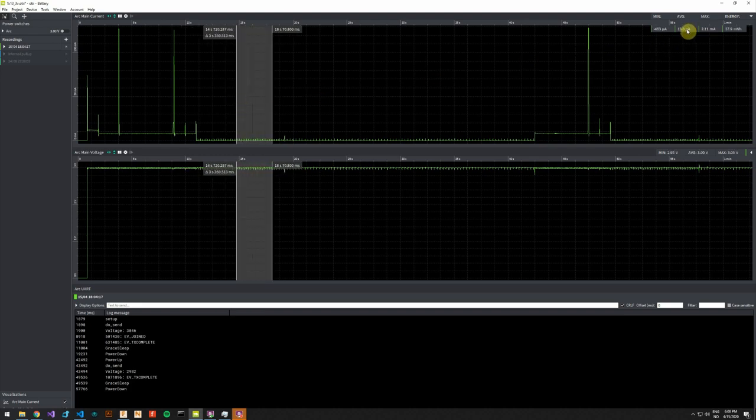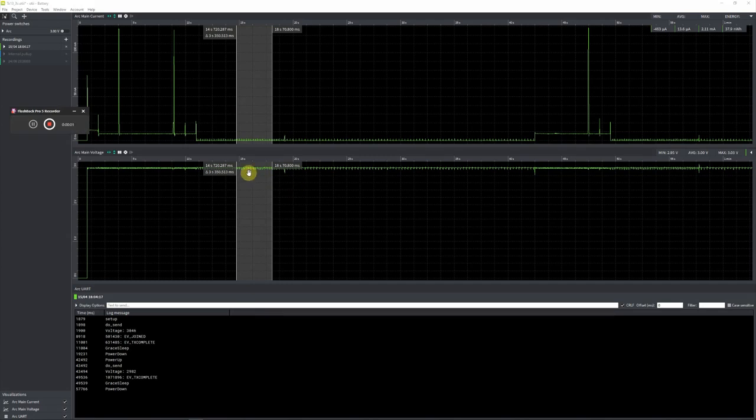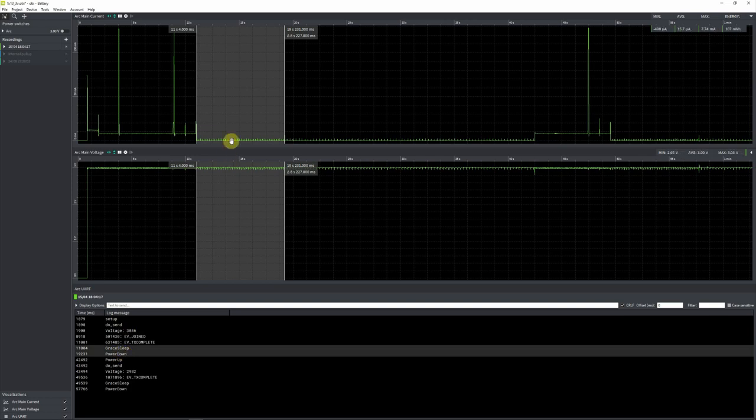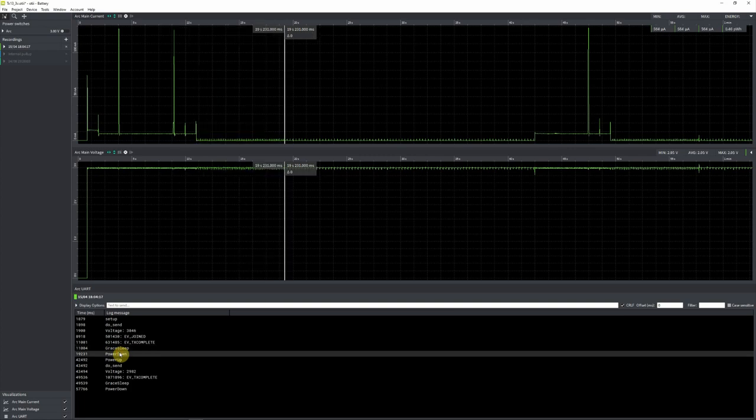That is about 13 microamperes, which is pretty good. And in this phase, the device is not responsive at all. So opening and closing the lid will not wake the device. When this grace sleep period ends, the device enters proper power down or deep sleep.